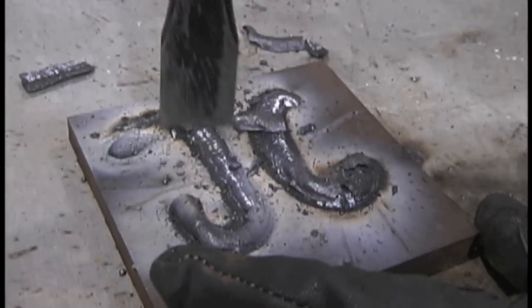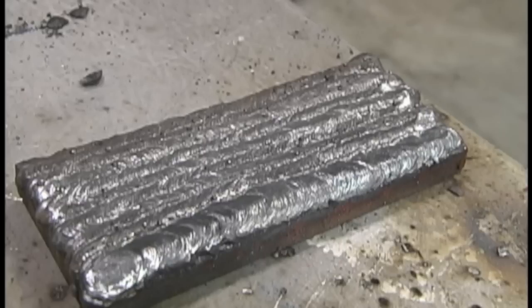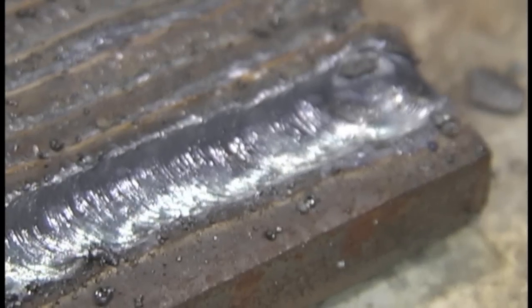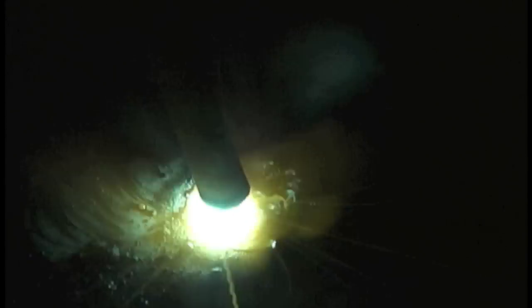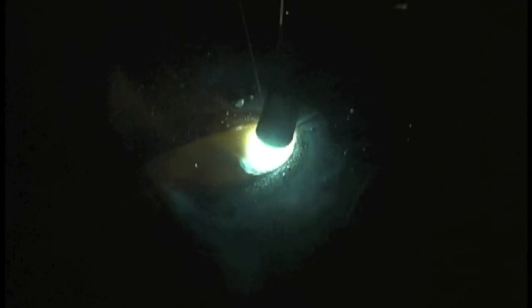The very first step is to do your initials on a piece of plate like this with a piece of soapstone or a scribe, and then tracing it with weld. The next thing is to pad a bead — cover a three by three by quarter inch plate with weld beads. This is basic stuff that anybody's going to do to learn welding. It's really good exercise, most bang for the buck in welding. Then a square groove weld, welded both sides.